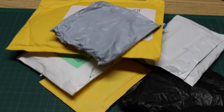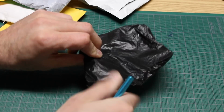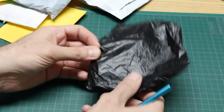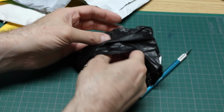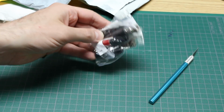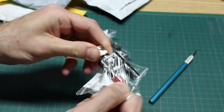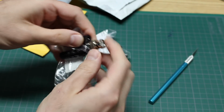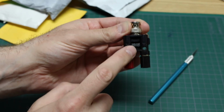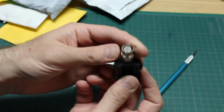Let's get going. Up first, it's called BNC. It feels kind of like a BNC plug and a couple of jacks or other plugs. So what is it? Oh yes, it's like binding posts with BNC on it. You could plug these into a piece of test equipment like an oscilloscope or a function generator. You would attach it, and then you can stick banana plugs in here and here, and you can attach bare wires. So it's a nice universal way to get at the scope.